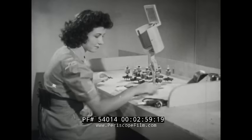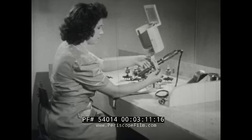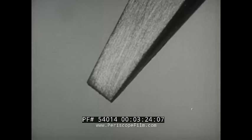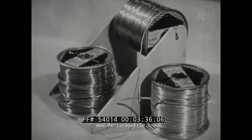Where the work piece is light enough to be easily handled, a holding fixture may be used for the iron. Clamp the iron rigidly in position at an angle convenient for manipulating the work, then plug in the iron. As the copper tip heats, it oxidizes. This oxide coating is a poor conductor of heat, and its formation must be prevented by tinning the tip with solder.